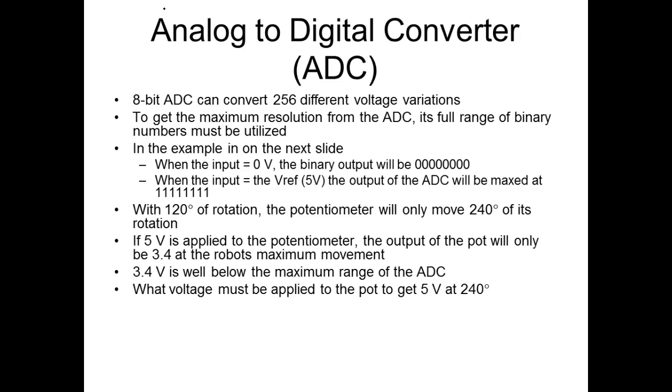And so like I said, if it's a modular PLC, you'll probably have to buy an analog input. If it's a fixed PLC, just about all your fixed PLCs now have analog inputs on them. The 1200s that we bought have a little section in the center, I'll have to show you that. It's called a signal card, that you can make part of the PLC. You don't have to put a module on it.